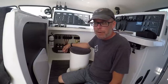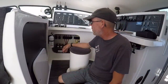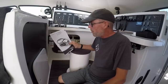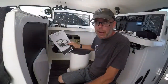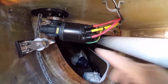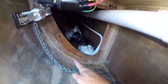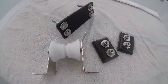There was quite a bit of other wiring coming off the windlass - a reed switch off the motor itself for a chain counter, which is optional; I didn't install that. There was also a thermal cutout that comes off the windlass motor - also optional; I didn't install that. I did put a remote access unit on there so we could have a remote out on deck to operate the windlass. One thing I did add was this roller system - as the chain came through the deck, see how close it comes to the motor? I didn't want the chain to rake across this motor at all, so I put this roller system in to divert it around and keep it nice and clear.